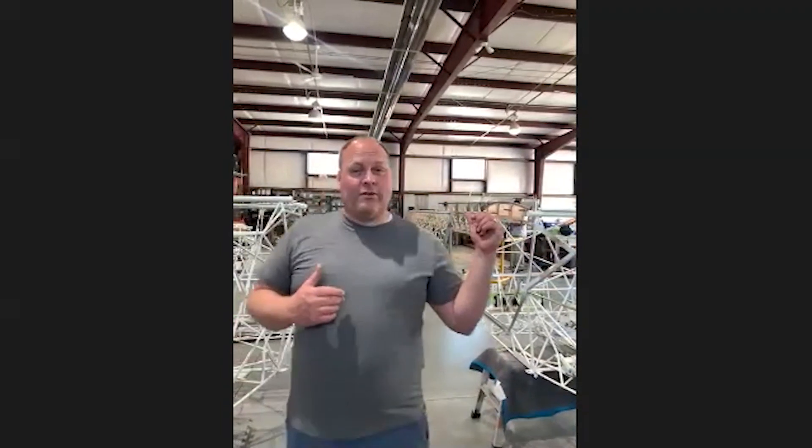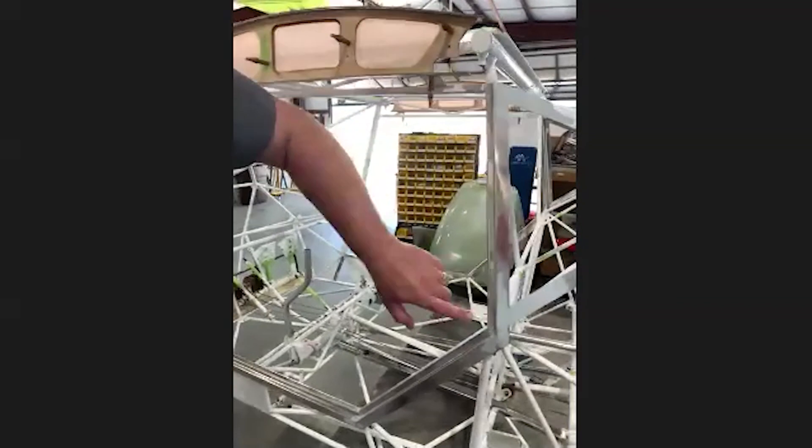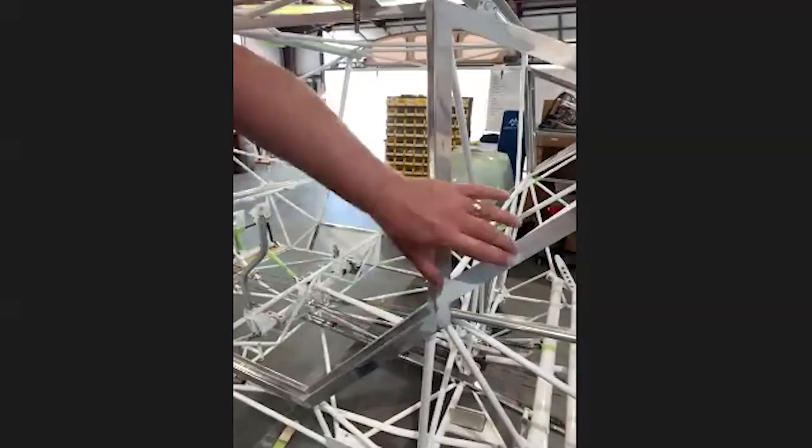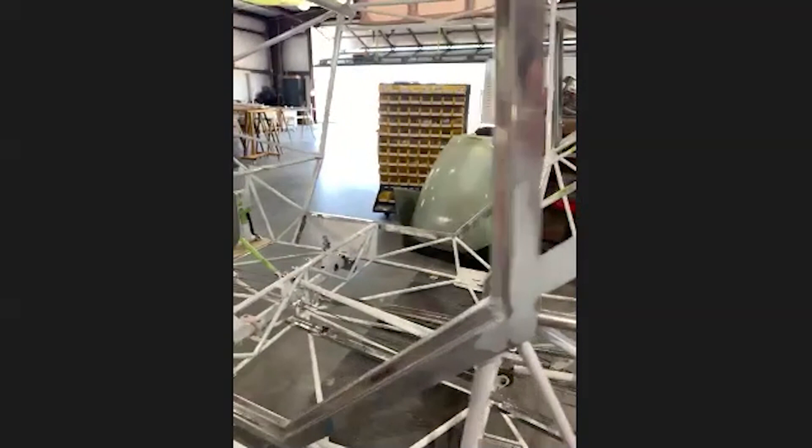One of the things, like you said, is planning to cut at both ends. What we do is overlap the joints quite a bit — some people try to fit them net, some do just a little overlap, but we actually do quite a bit of overlap. We have an airplane here with the door frames finished so we can look at that. We started doing a bunch of body work on them, and some of these end up overlapping where you have to transition the body work off the corners.